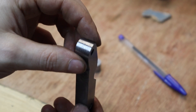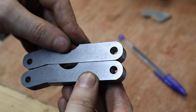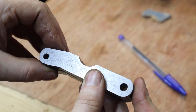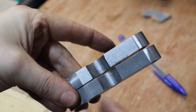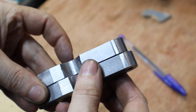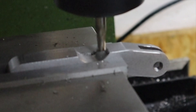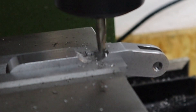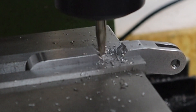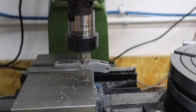That's all the fancy radii done now on both parts of the tools - really happy how both of those came out. They're pretty much identical to each other, which is exactly what we want. Next operation is to machine a slot in the top of these radii to accept the lead screw, which will act as the clamp for these tools. We're going to focus on machining the slots in the lobed section - first procedure is to get a nice flat bottom there to accept the drill bits which we'll use to take the bulk of the material out.